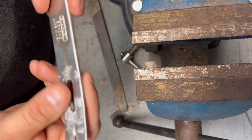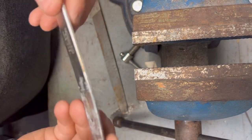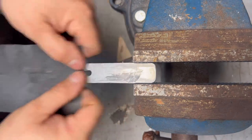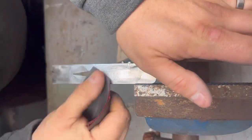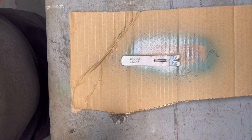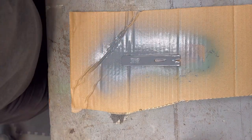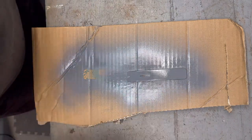We're going to do a quick heat treat off camera, get it sanded back down, and I'll explain the heat treat during voiceover. Next step you'll see is painting. With the heat treat done, just doing some finished wet sanding — some was done off camera too — using 320-grit wet sandpaper to take off the scale and get it to its finished state before primer coat. Then applying a nice primer coat and letting it dry.